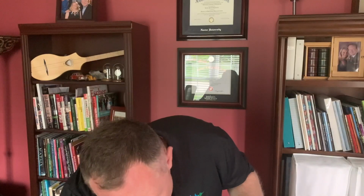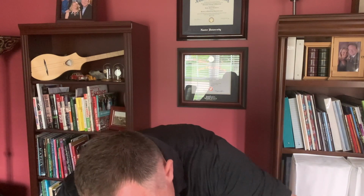When I've done this in the past, and I've had a lot of ceremonies where I've done this, I just have a half-wave antenna, sitting at maybe hip level. Hip level is the standard height of anybody's microphone setup or gear if you put it on a little table or something. When I'm talking half-wave, I just mean these guys, the longer half-wave as opposed to the short quarter waves. These half-wave antennas are great, but if they're sitting down at hip level, there's all kinds of stuff in the way: bodies, chairs, there might be trees. So get high, and even if it's just one, get one high up, line of sight.